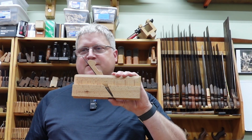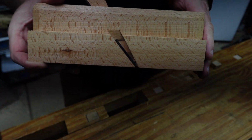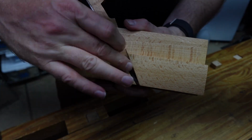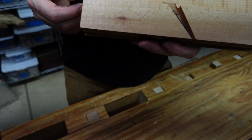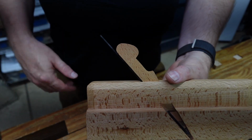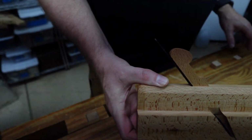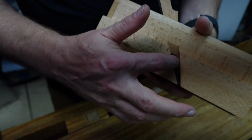Let's take a look at the parts of the plane here. So we've got your heel and your toe, just like your foot. We've got this wedge, of course. This is called the finial. This finial is basically like one of the calling cards of any kind of plane maker. Each plane maker typically has their own design. You've got this escapement where the shavings come out.